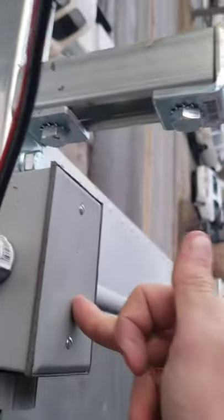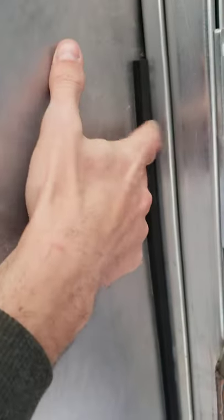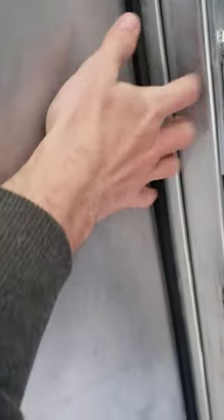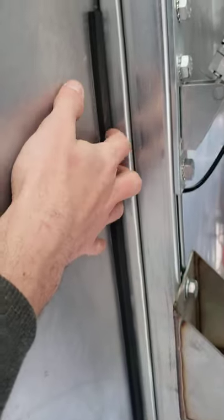I got the hardware from Home Depot or Lowe's — they're waterproof. These are super strut parts. Under the panels I have neoprene foam pads because the roof curves up from the middle, so the pads level it out and compress down to hold the weight. The super strut just holds the panels from moving sideways and supports a good portion of the weight.